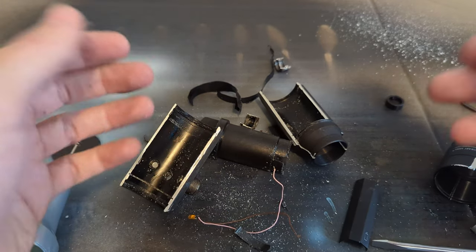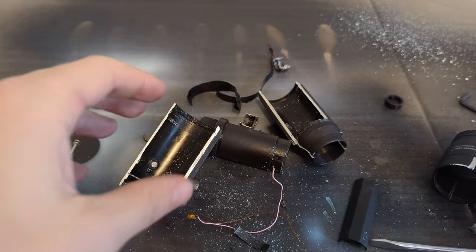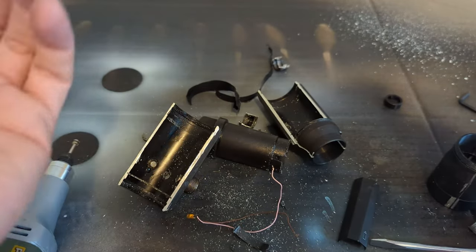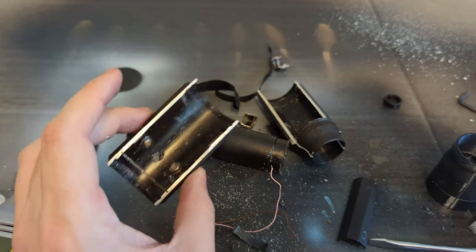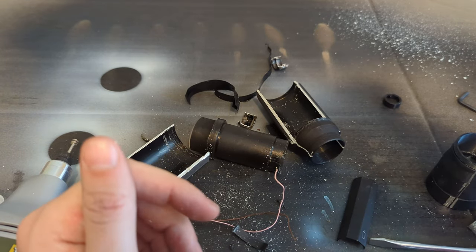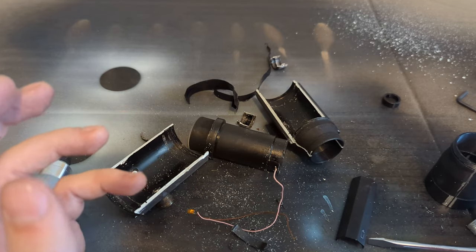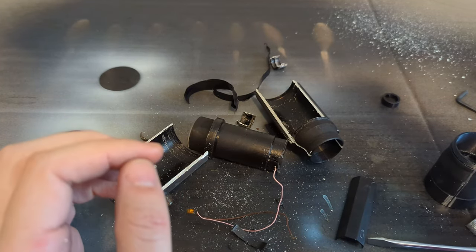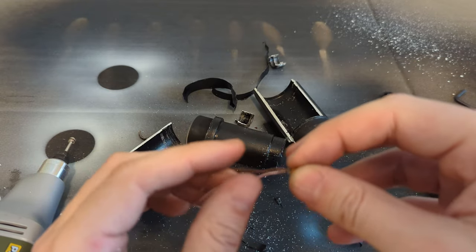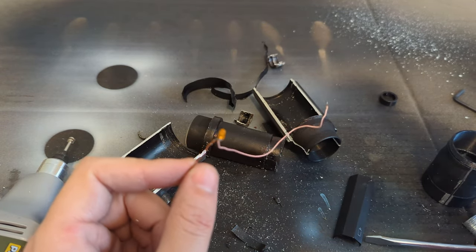There are two ways to look at this. Looking at this Primary Arms version, it is kind of surprising that they sell these as cheap as they do — that's what manufacturing in China can get you. Make a bunch of these, the R&D element is pretty low, and there are very similar designs everywhere. It's basically the parts and everything — a pretty big bill of materials with a bunch of parts to keep track of. But the circuitry was a little power regulation circuit right off a datasheet, a basic 3mm LED, and the brightness was just a resistor network of LED pull-down resistors changing current flow.